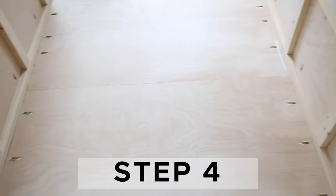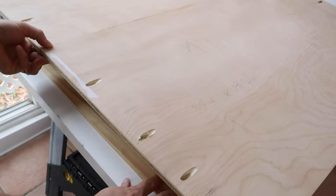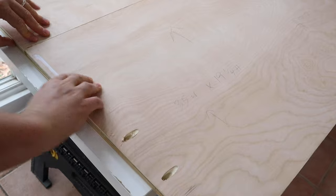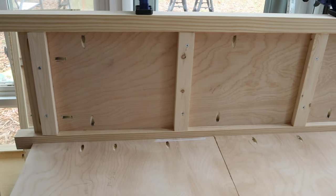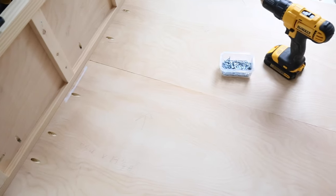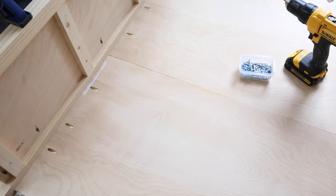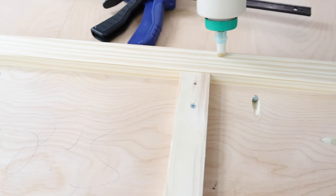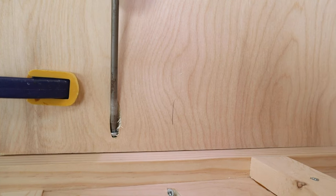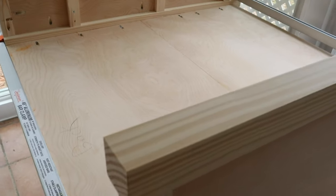Step four is to attach the back of the bookshelf to the sides. Place quarter-inch scrap wood under the plywood backing board sides to help the 1-inch Kreg screws go into the 2x2s more securely. Place one side frame perpendicular to the plywood backboard with the plywood aligned with the top of the side frame. Clamp in place and attach the two together with wood glue and 1-inch Kreg screws. Repeat for the other side frame on the other side of the backboard. We found our 48-inch clamps worked the best for this step.